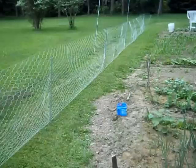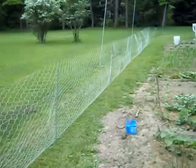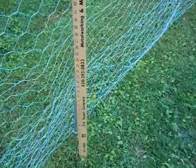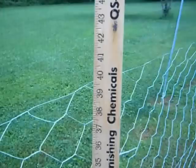Since I completed this 50-foot section there's no point showing the other 50 feet because it's going to be the same. Important things I learned along the way: find your half-inch pipe cutter or borrow one — it's a lot easier than the hacksaw. You might not have to drill the bottom hole since it's not supporting any weight. With a seven-inch skirt at the bottom and about a four-inch overlap in the center, we end up with a 39-inch fence, and no rabbit's going to jump that.